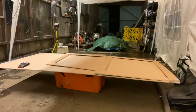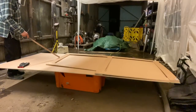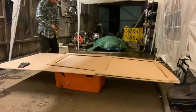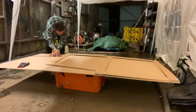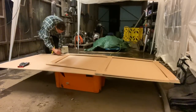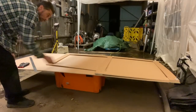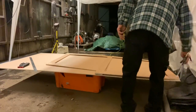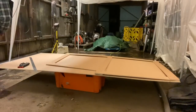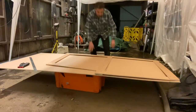And then up here at the top end, remember I need to leave a gap — at the highest point I need to extend it from the top of the template by about 20mm. I should have worked it out properly, but I haven't, so I'll have to mark it out like this and then maybe do some trimming back on the boat. So now I've got my points marked, I can take off the clamps and this template has served its purpose — possibly redundant now.